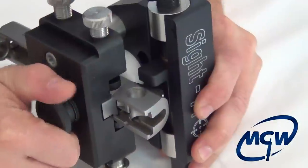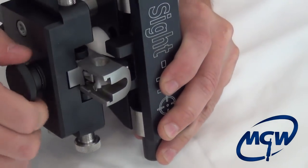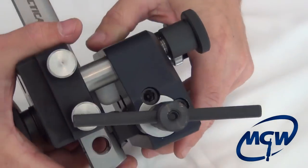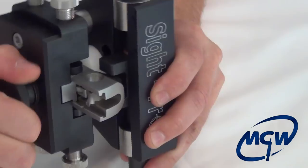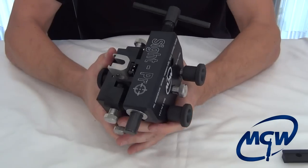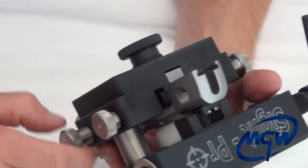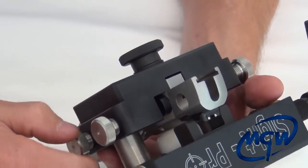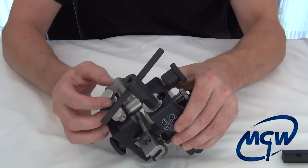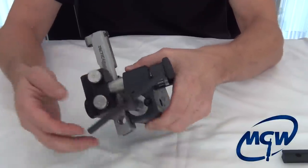Break the clamp that holds the slide down and move it to where we want to get it — about the center. Clamp that. Now we take the little slide clamps. You don't need a lot of pressure; just bring them in until they stop. There are four of them — bring these two in — and that puts a nice support on each side of the slide.